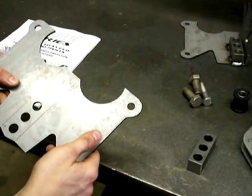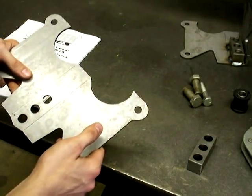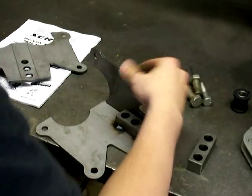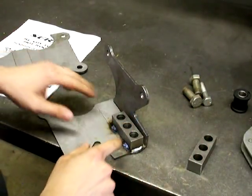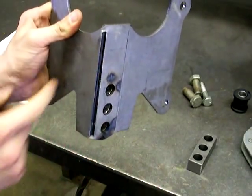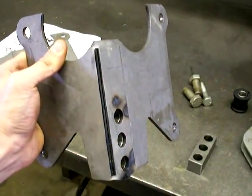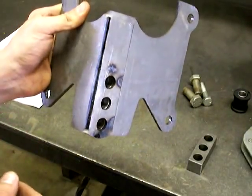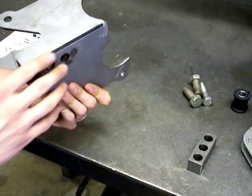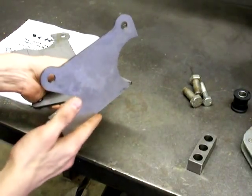It's easy to modify if you've got a three and a quarter inch housing. I've already started one here — I've welded the block to the plate and bent one side already. You can see the laser-cut slit here, and after you bend it, it forms a nice corner-to-corner joint that's really easy to fill with MIG weld, grind it flush, and still have a lot of weld in there.